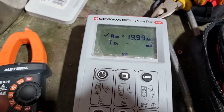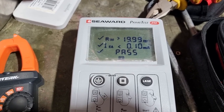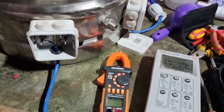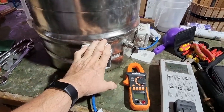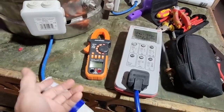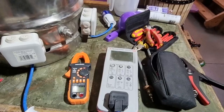This is earth leakage that we're interested in — very good, good, good, good. We have a pass. Get the cover back on, give it a good clean out on the inside, then fill it with water and check it — make sure there's no leaks. Only temporary because we are moving on to the bigger kit quite soon, but this one will still be used as what people apparently call a pilot kit for recipe development.